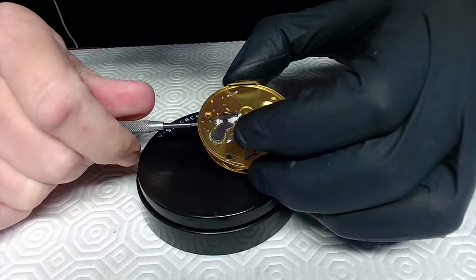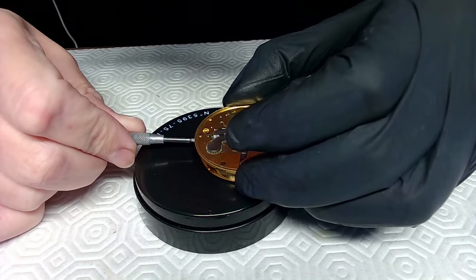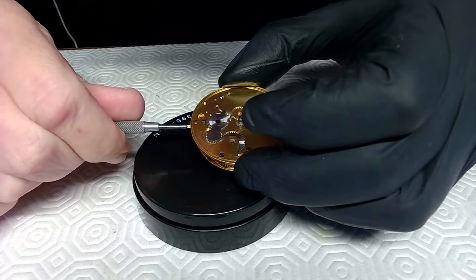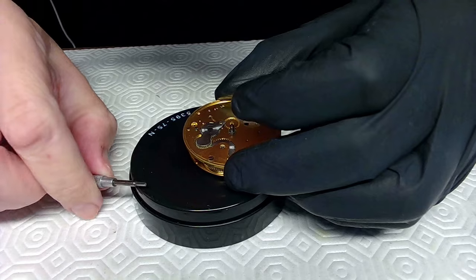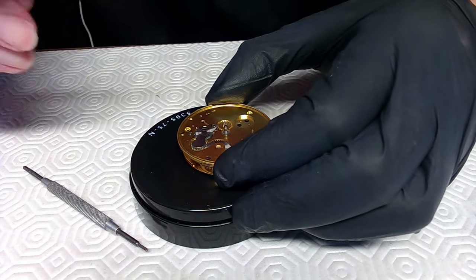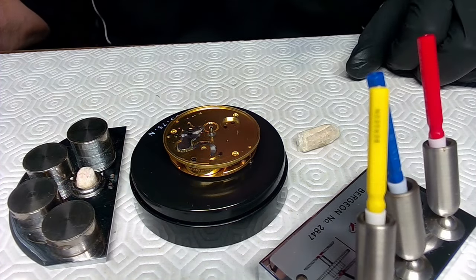Pushing inward engages these gears for winding the mainspring — and that's nice and easy to turn, which tells me the gears on this side are fine. I could put a little oil right in there to make that smoother. This screw here should be tight enough and it is, so there's no problem there. I could oil right there to make the mechanism slide back and forth easier.